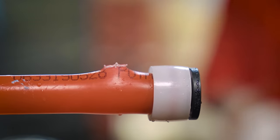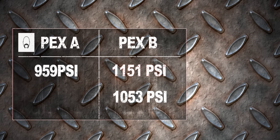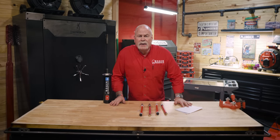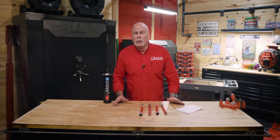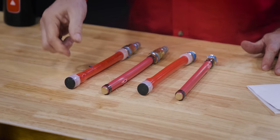Testing is complete, and it really did surprise me. PEX-B first piece: 1151 PSI. PEX-B second piece: 1053 PSI — that's 100 PSI difference. PEX-A first piece: 959 PSI. PEX-A second piece: 910 PSI. Your water pressure at home should never get that high, but wouldn't you want what tests well above normal? Nothing leaked at any of the fittings — all the crimp connections, all the expansion connections — none of those leaked or dripped at all. Go back and look through the slow motion; it did fine.